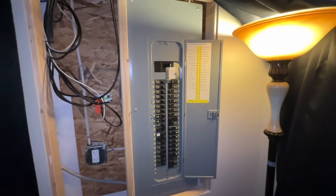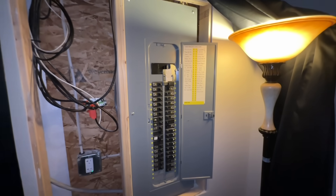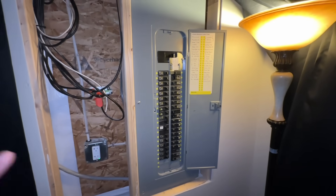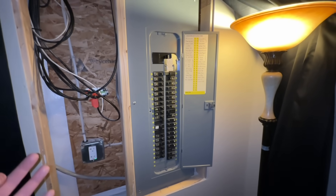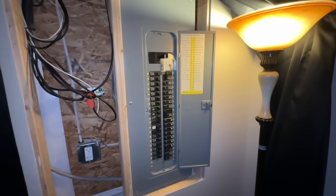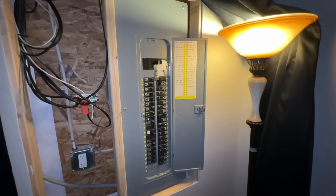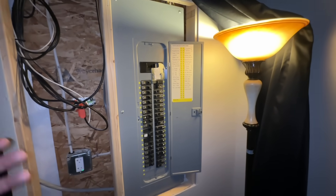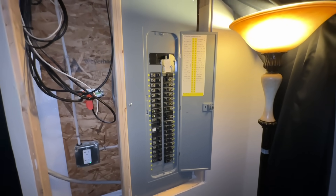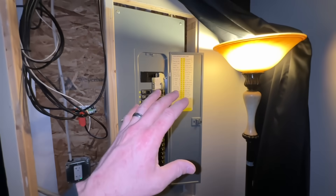I have two refrigerators and one freezer — I round those up to about 1,000 watts each, since refrigerators can vary from 300 to 800 watts. That's 3,000 watts. My electric furnace blower and hot water tank blower — let's say 500 watts each, another 1,000 watts — now we're at 4,000 watts. A microwave might be about 1,000 watts, so now we're at 5,000 watts. Then go through each room: each light is roughly 10 watts, so calculate how many lights and devices you plan to run.